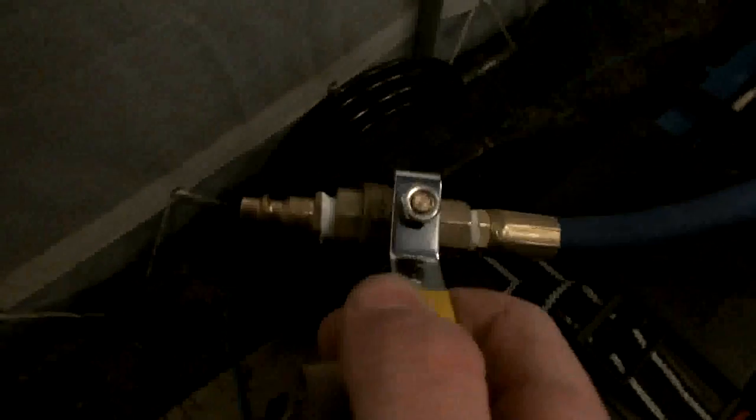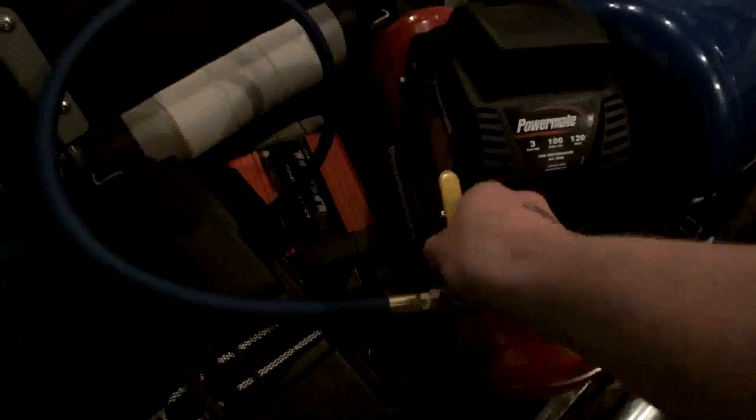Compressor will charge up its tank and then go through a quick connect system to this valve here. This valve is a 1/4-inch ball valve with a male M-type air plug on it. That just gets plugged into here. And then you can turn on and off the system. So when you turn this on, it charges the system. So I'll just turn that off for now. So, that then goes through this whip hose to our first stop here, which is an oil and water separator.